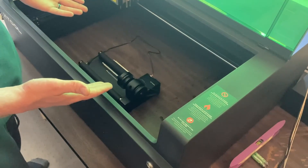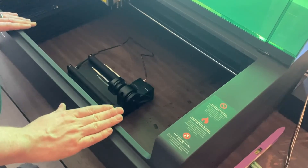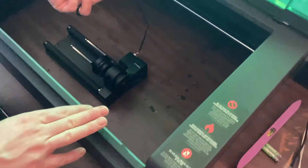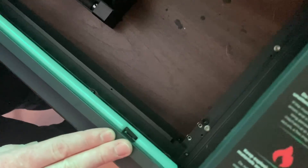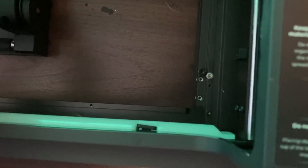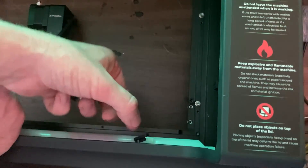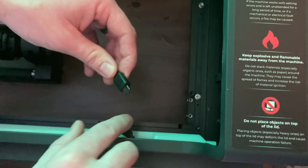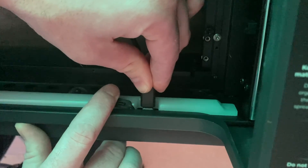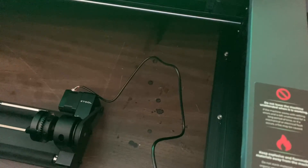Once you have your rotary tool inside of your machine, make sure that the power is off and disconnected. Take your connection cable and right here inside of your S1 tool you will see a little piece — that is the plug cover. Go ahead and open that up and then take your plug and plug it in right here. You are then ready to start operating.